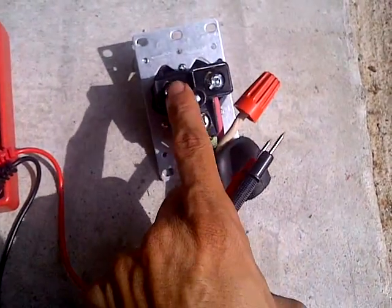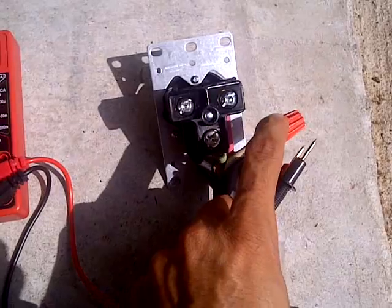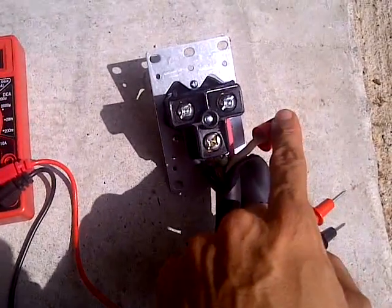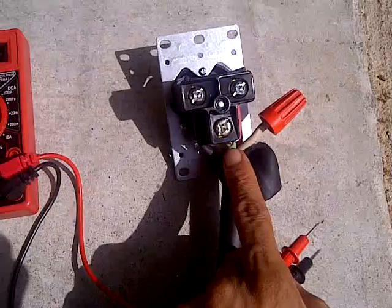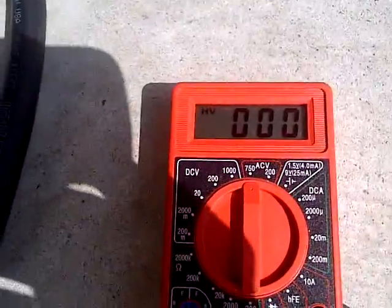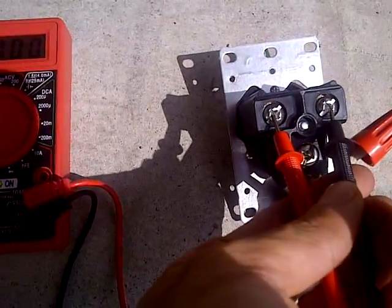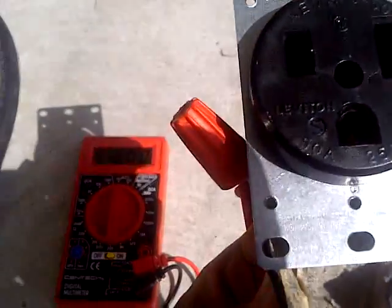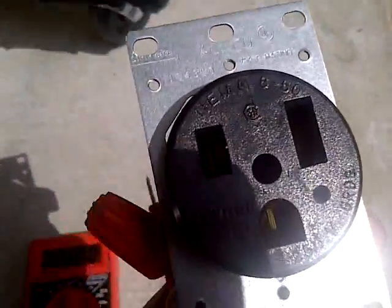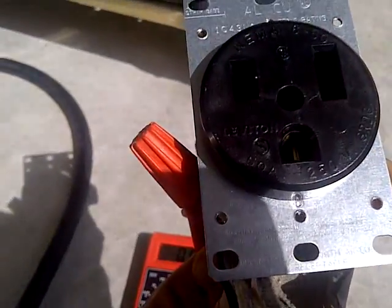So if I put this hot wire in here where this would be, maybe it would be another 120, and I would get 250 or 240. So I put this in, capped this off. This is the ground, which is kind of simple — it just stays there. Then I tested it again on the voltage. And wouldn't you know, of course it's zero now because it's not on. But when it was on, it came out to 225, 250 volts. So I was like, okay, wow, it worked. This plug is a receptacle — it's a NEMA 6-50.